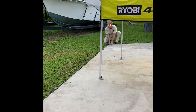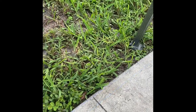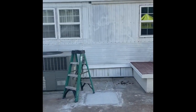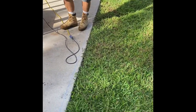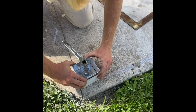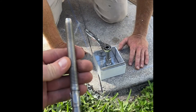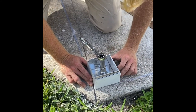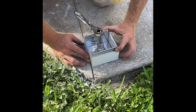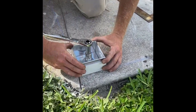Once we found our boundaries and marked them with a blue chalk line coming off the principal building down the side of the slab, we are now putting in our footer clips, which consists of a wedge type anchor and a u-clip. Here's your wedge type, here's our five inch u-clip, and we have a four inch beam cut off for our guide. We're going to do this process and repeat another nine times.